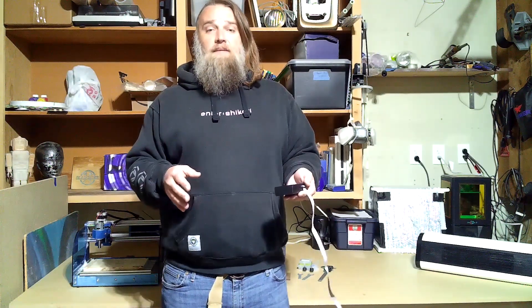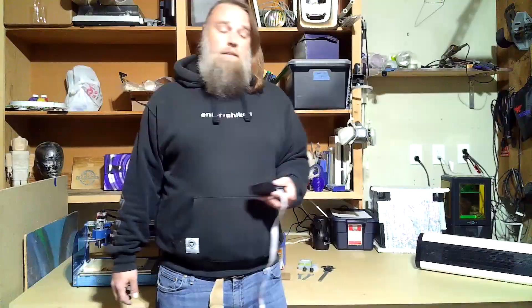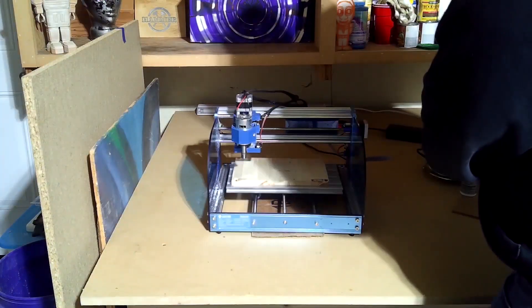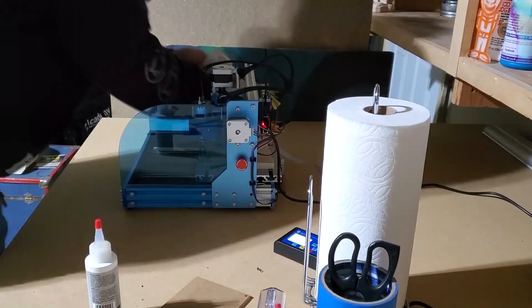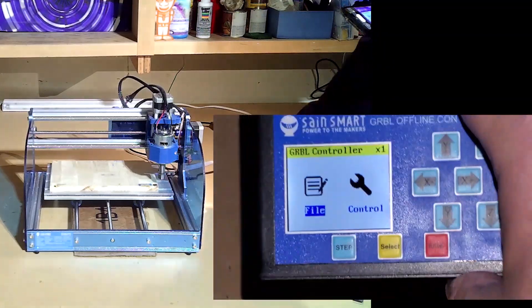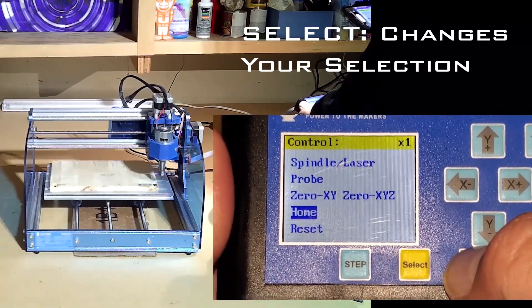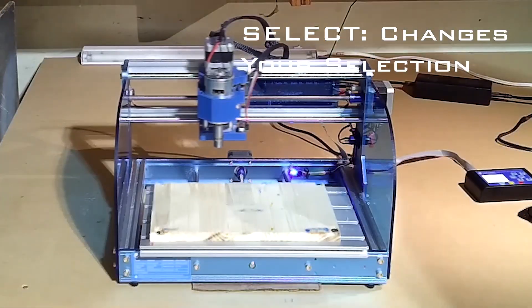Before we get into all that, I need to clean up from my last cut and remove it. So all cleaned up - I have moved my XYZ to the max opposite direction of my machine's home. During cleaning, I broke the metal tab of my limit switch, but luckily there is still enough for it to work. When cleaning up I'll use paper towels, brushes, shop vac, and air compressor. I have applied my super lube PTFE to the threaded rods, and now I just press home and it will distribute the lube across all the threaded rods. Now I'm just getting the acrylic ready using the tape method.